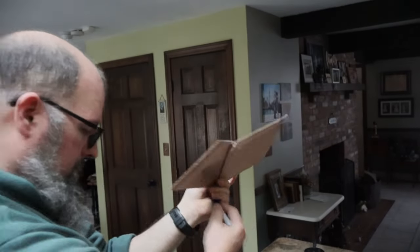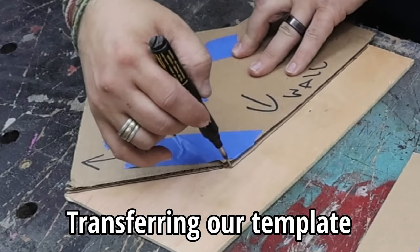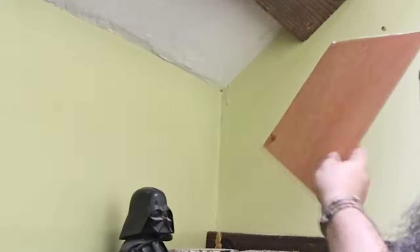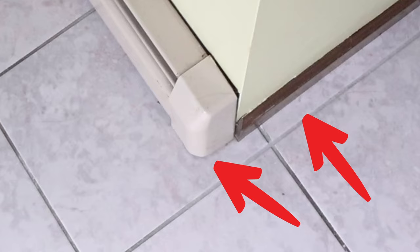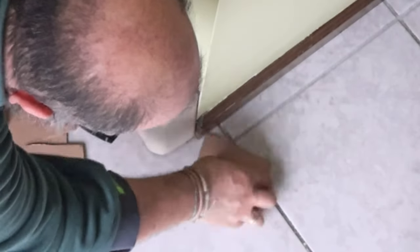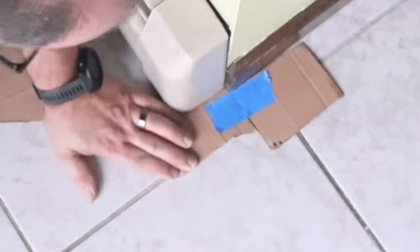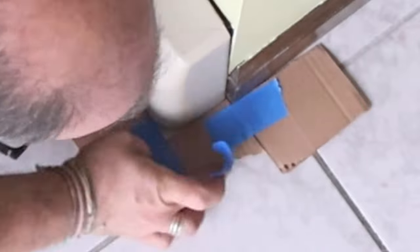Now, let's cut it out and see if it fits. It fits! Now let's try a much more complex, odd shape, shall we? Take the section of floor in our kitchen. There's molding, a corner — and a rounded corner at that — and a heat register. Let's say I needed to fit that weird shape. Using the same method we just used on the ceiling, we can use that here. Just want to use a lot more piece of cardboard and a lot more tape.